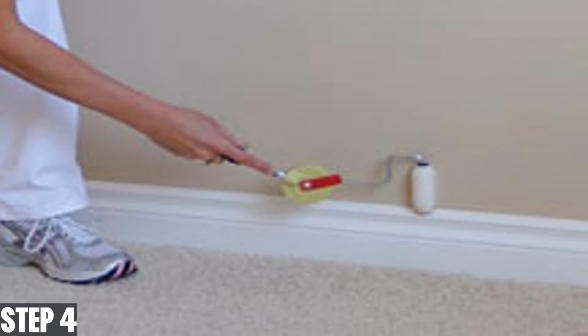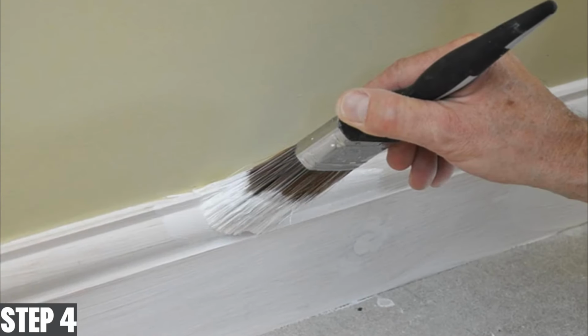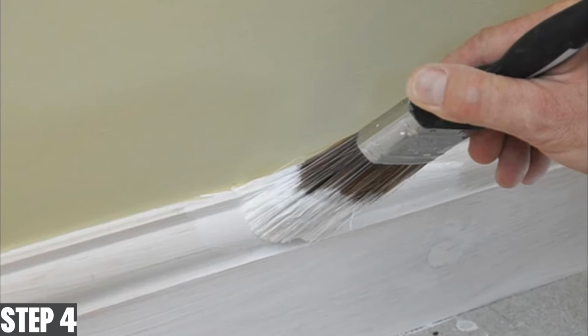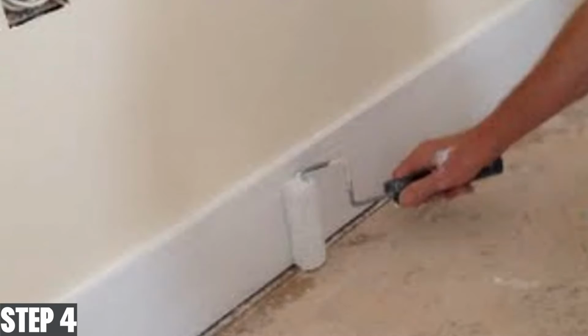Because we're talking about painting skirting boards, we'll cover cutting in along a horizontal line first. So this will most likely be painting the top edge of the skirting where it meets the wall. We recommend that you start painting approximately 2 inches or 5 centimeters away from the corners. When you start painting, it is best to use a single stroke. This helps to push the paint from the brush onto the surface and creates a smooth surface upon which the brush can glide.